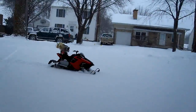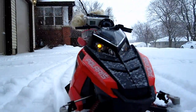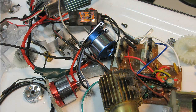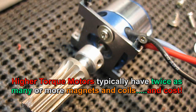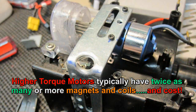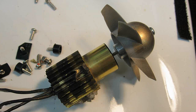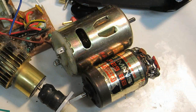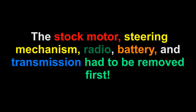Here I'm showing you all the designs, the failures, and what actually worked and didn't. I tried three different brushless motors, but since they were designed for fans and airplane props they don't have good low-end starting torque — they wound up pulsing and I couldn't get the machine to move. Finally I got an in-runner brushless to run, but it completely destroyed the plastic gears and I had to start all over with nowhere to buy another transmission. So a whole new plan — I finally wound up with a plain old 500 can motor and a belt drive.